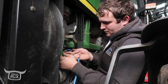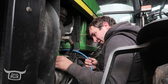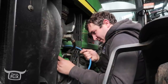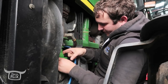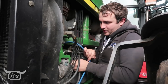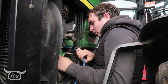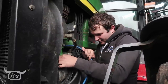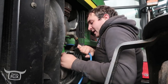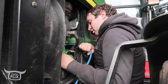In a scenario where you land and she's pressure testing and she's leaking, you'd just say right, I'll do a vacuum test. If there's no pressure in it, it could be from anything - especially tractors where you know it may have been split before, somebody let the gas out, or it's got an aircon part or something in between times. She'll do a vacuum test and hold the vacuum to make sure it's not losing vacuum. If it loses vacuum she'll let me know. What we'll do is put in no gas but a UV dye. The UV dye - when it comes through, you'll see the UV dye out. I've not had to, you know, do that more so.